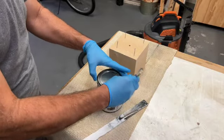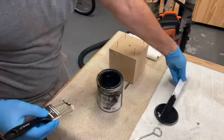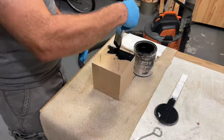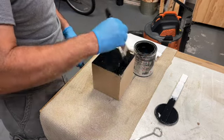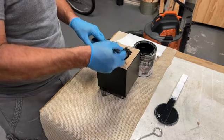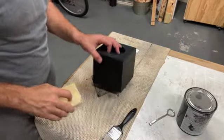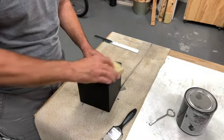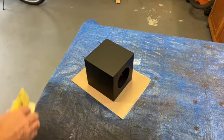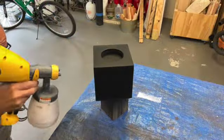We're going to paint the piece flat black. We'll start with a brush and slowly build up the layers. First coat of paint is dried — we're going to switch over to 220 grit sandpaper, give everything a light sanding, and give it another coat. After four coats of flat black, I just don't like the finish, so I'm going to sand it some more and then go back to my tried and true polyurethane.